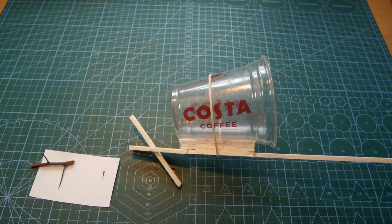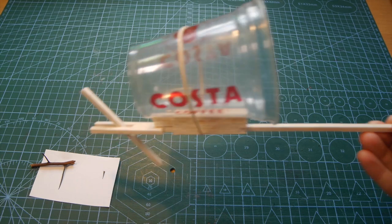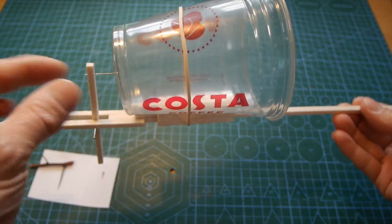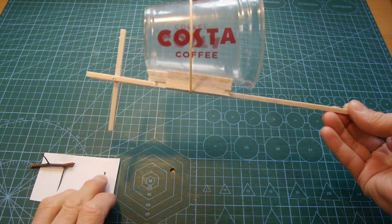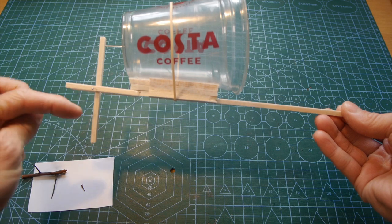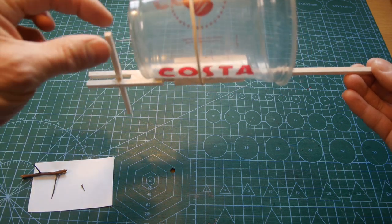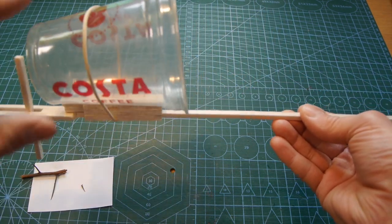So let's have a quick look at the contraption I've built, and then we'll test it on the record player. I've got a long handle here to hold the tonearm, and here's our horn. Here's our pin that's going to tap on the back of it and hopefully pick up the vibrations. There you can see a tiny little thorn, and the idea is that the thorn will poke in the end of this. I'm going to shorten this so there's a better mechanical advantage. Then we can put it on the record player, and as the record player turns, we want this to go from side to side, and hopefully we'll hear the music coming out of our cone horn.